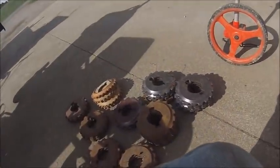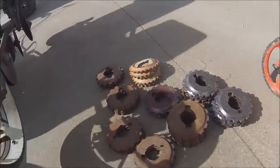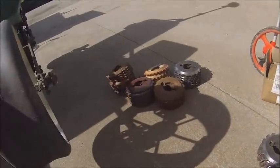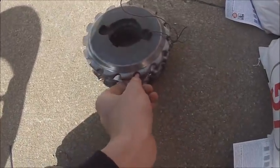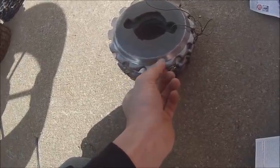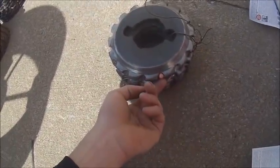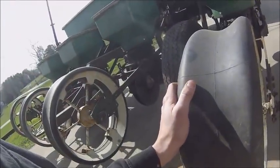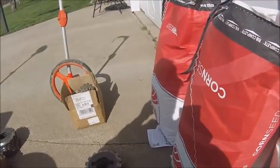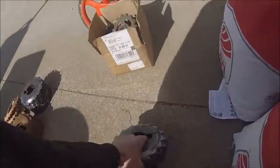So, anyhow, crack these bags open and figure out what plates need to go with what. Well, I couldn't find a flat plate that the flat seed actually fit worth a damn in, but it fits damn near perfect in a round plate. And just by chance, my rounds fit damn near perfect in the same plate. So I might get lucky and be able to use the same exact plates, which will give me the same exact sprockets for both seed sizes, which would be mint. So, slap these things in the boxes.